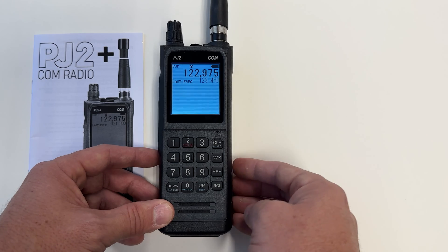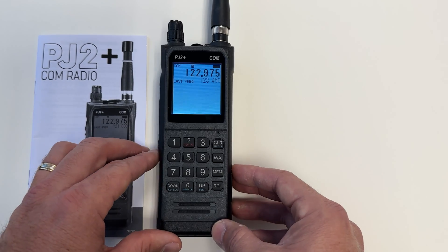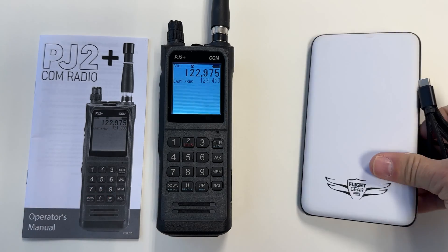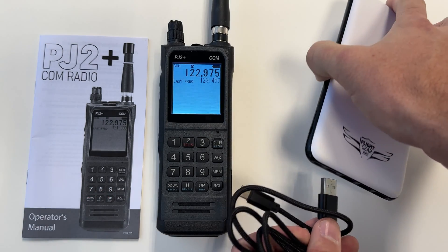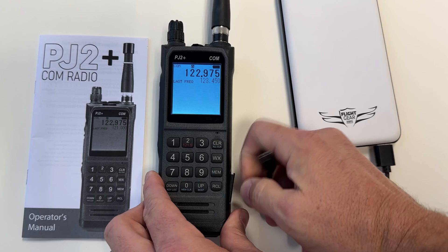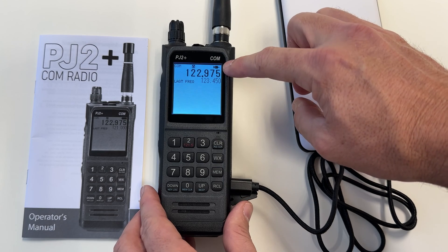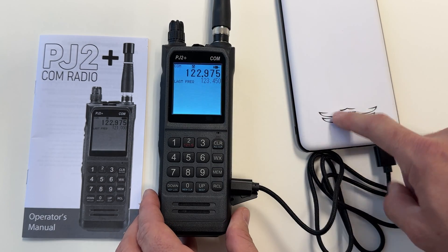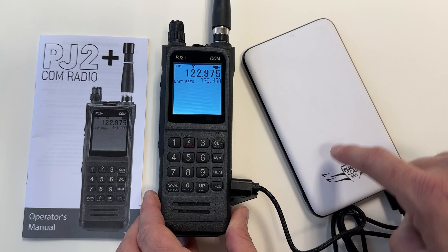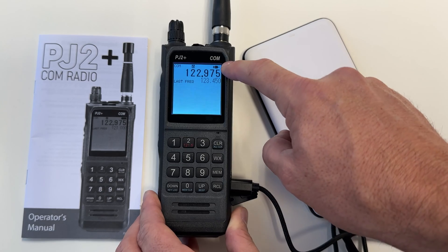When using the battery pack on the PJ2 Plus, you'll get 6 watts of peak output power. This radio can also operate on lithium ion battery packs with a charging cable — anything that can provide 2.4 amps will operate this radio. When plugged into the side of the radio, the battery icon changes to a USB plug icon, meaning the radio is now getting power from that source. When on power from a brick, cigarette lighter, or wall plug, the peak output power is limited to 5 watts.